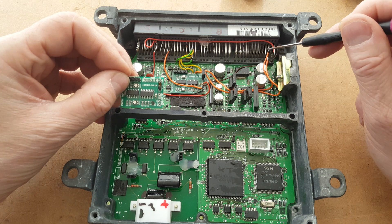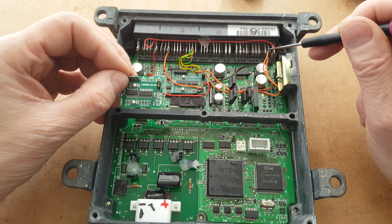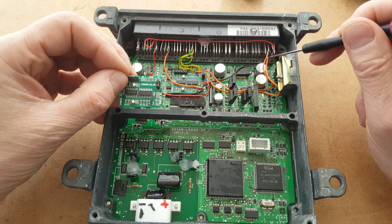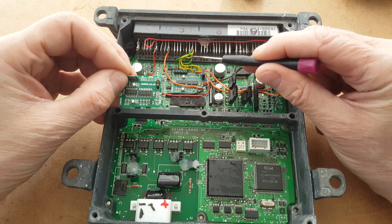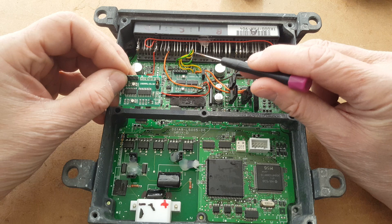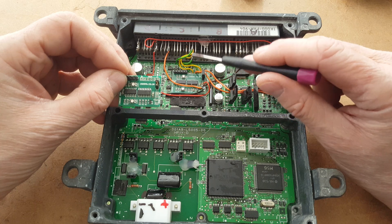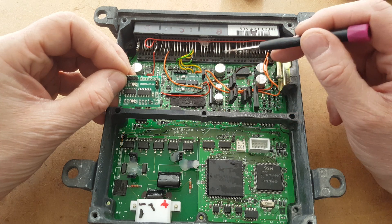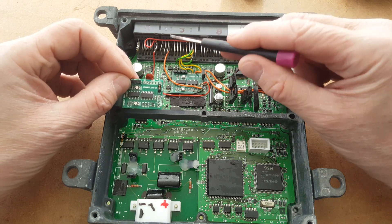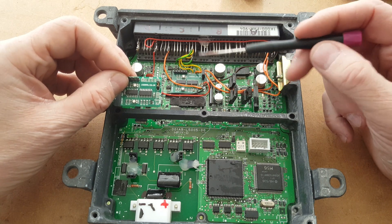When you've cut the pins, make sure you tin them with a soldering iron and plenty of solder and flux. You need a nice tinned end on those pins because you're going to be soldering wires to them in a restricted space, so you want the solder to flow on easily. Make sure you tin the ends of your wires too so they click on there and solder on quite nicely. Double check with a multimeter if needed to make sure you haven't got any short circuits — make sure none of the pins are touching each other.